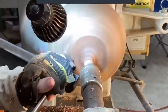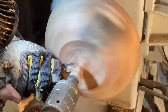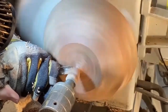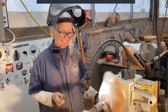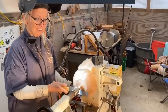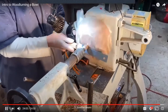What I did to heal the crack — we lost the audio on that — but you basically take dust from your turning, fill the crack with that, then fill it with CA glue, and then sand it back down. Now I'm just whittling away that nub. This too is a little unnerving because if you turn it through and it goes flying, you might destroy your bowl. So I get almost all the way through and then take a little saw and saw the difference, then sand that nub down.